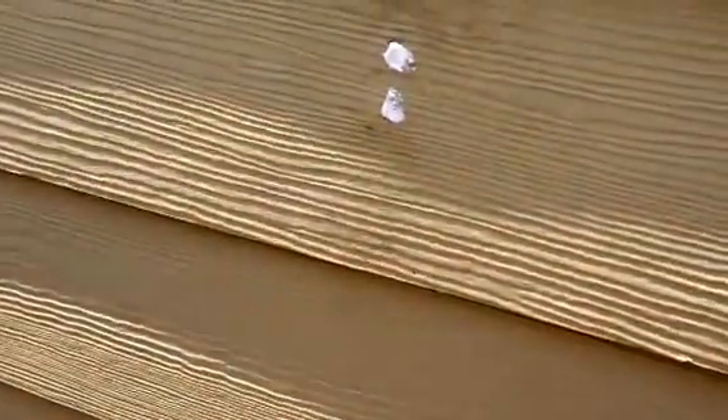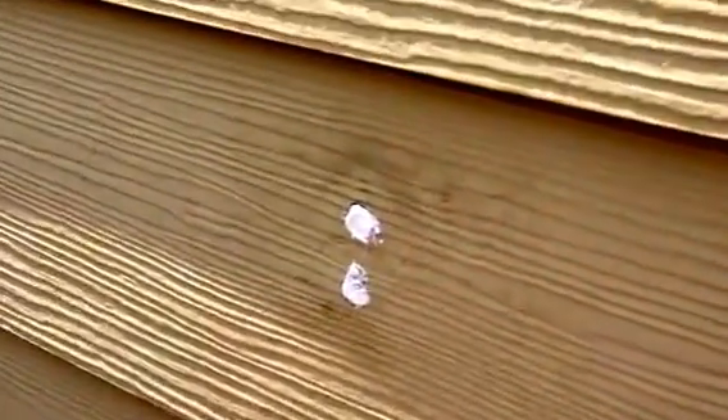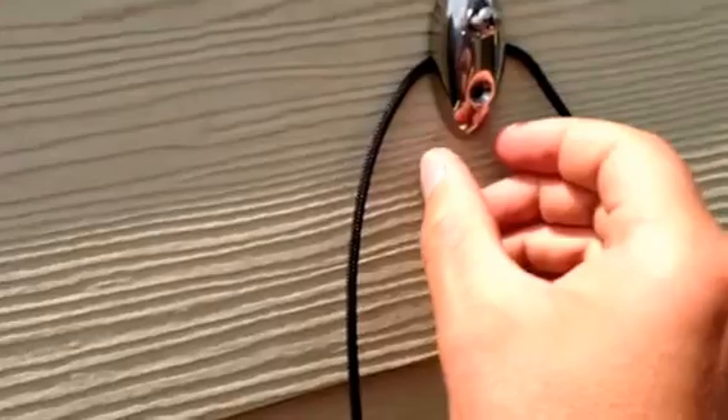So I've cut the zip tie, pulled it out of the packaging, I've marked my holes, and I've put two little dots of silicone there. So when I screw in the halyard hanger into the wall, it's 100% sealed. So I'm going to go ahead and start my pilot hole, get it lined up, put my second screw into position.